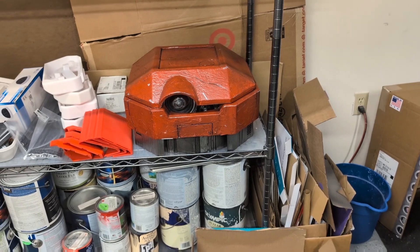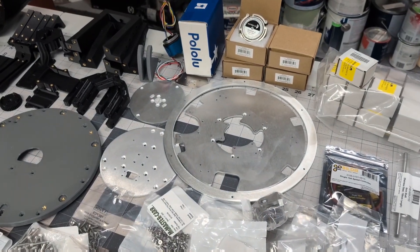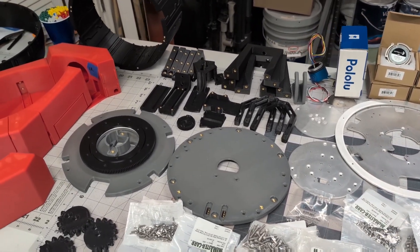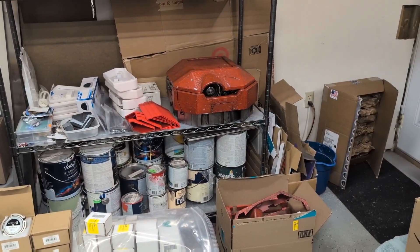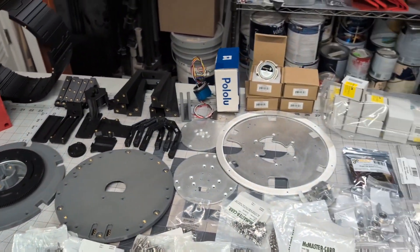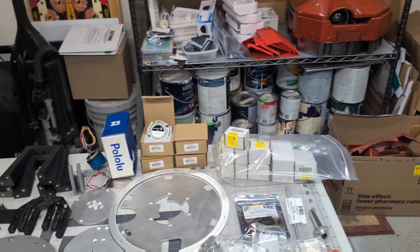The mechanism is definitely what I would consider to be next level. We've got some custom cut aluminum parts, and there are some CNC machined parts that are going to be eventually making their way here. The entire mechanism is changed, including a slip ring so his head can turn 360 degrees. It uses much higher end components, and I really felt I could use this as sort of my test bed — the last step before I tackle my next droid.